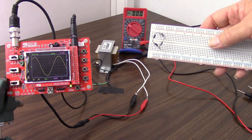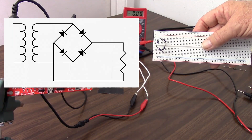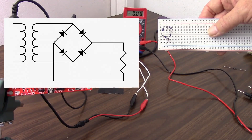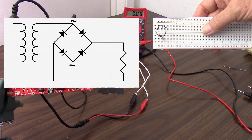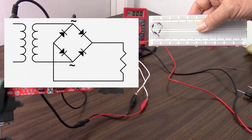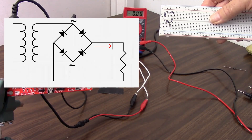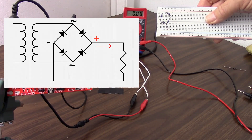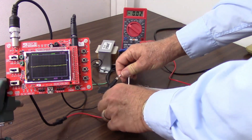It looks like this in the schematic. There are different ways to draw this — I prefer to draw the diamond-on-point version, but you might see it drawn different ways. The important thing is that your AC goes to the points where a cathode connects to an anode at the top and bottom of the diamond. Then you get your current flowing out of the side where we have two cathodes come together — that's where we will have our positive voltage. Our negative voltage comes from the other end where the two anodes come together.